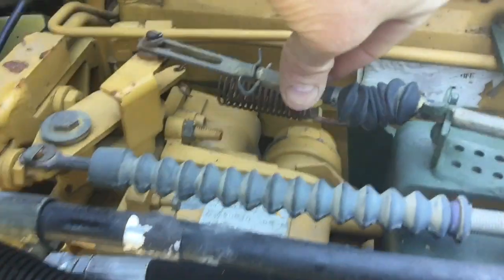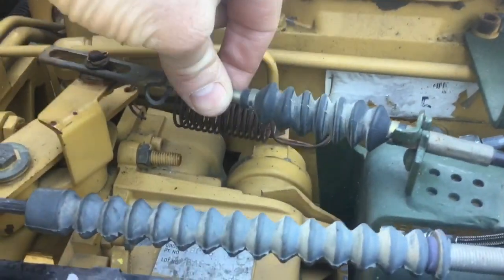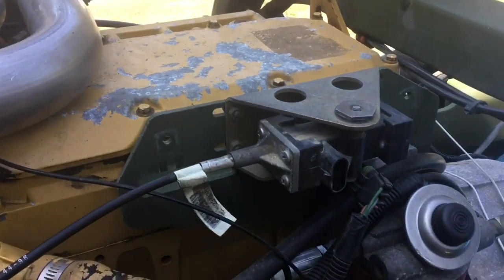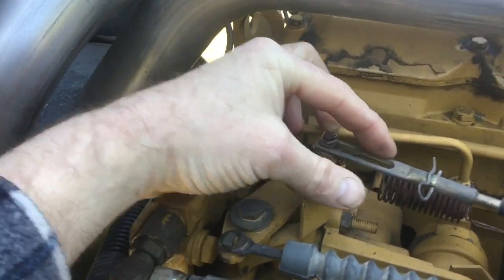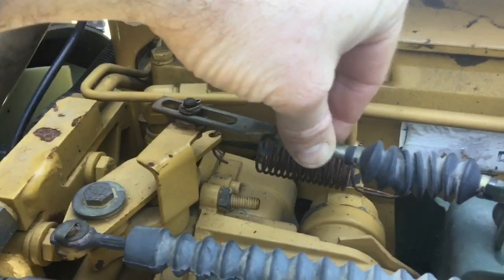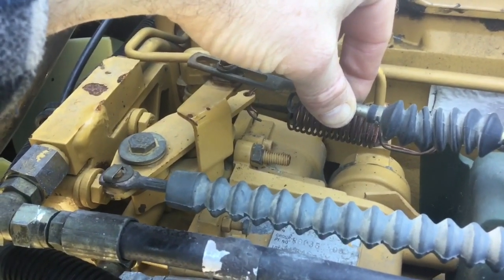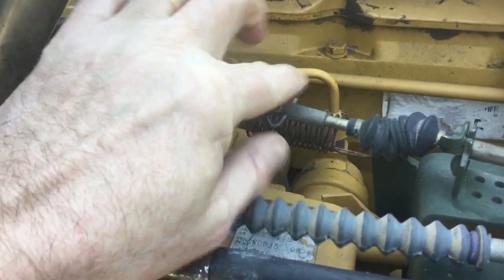Next, you want to check that this device slides cleanly in its groove. You also want to ensure that it's all the way at the end of this groove, which means it's holding just a little bit of tension on the resistor, so the resistor wiper is not all the way at one end of its travel. The slot is there in case this cable or the resistor fails and jams — it won't hold the throttle open when you let off the pedal. The throttle will still be able to rotate back to the idle stop screw using this groove in case this thing jams up.